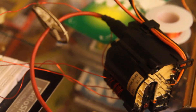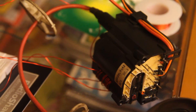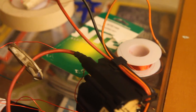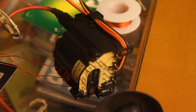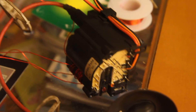So I got a jolt from one of those small capacitors in there as I picked the thing up. With all these extra leads and everything — these are the filament wires — they're just out in the open air right now and really need to be trimmed back. Before I do too much more messing with this, I'm going to trim all this stuff back, pot it in epoxy, and cut everything except for the ground lead. That way hopefully I won't have any more unpleasant surprises when I grab this thing. That was not fun.